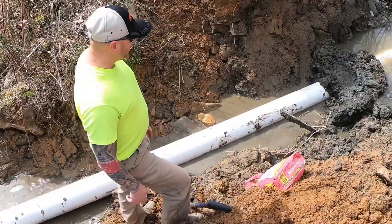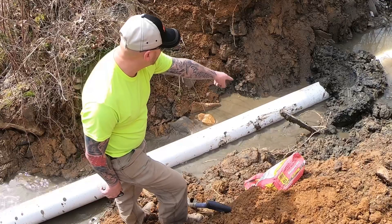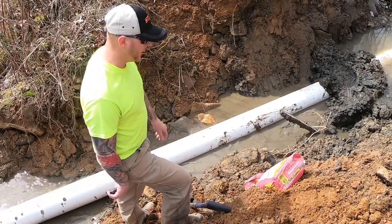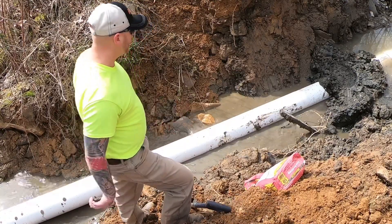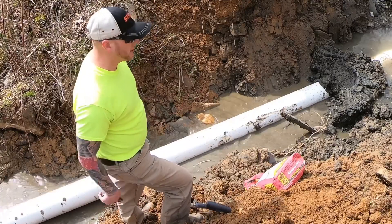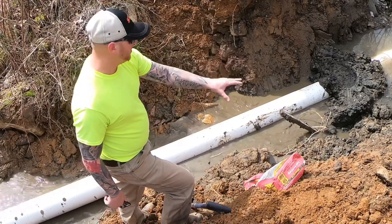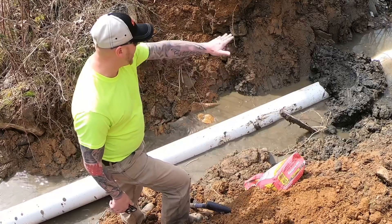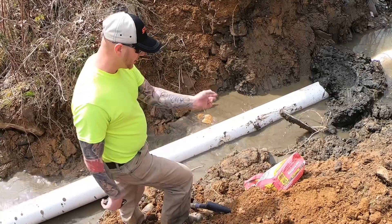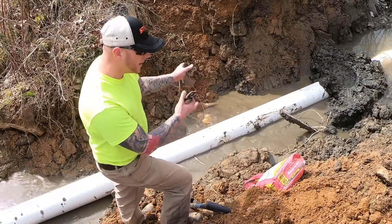The next part I'm gonna have to move quickly and with a purpose. You can see right through there — water's flowing through that little dam I've made. I've got 100 pounds of quick-setting concrete here. Ideally I would have just dammed it up and pumped the water, but since it's a small dam I can do this quickly. I'm going to grab a couple of buckets of soil — good clay here — pack it down and slow that water flow, then run down and split my bags of concrete and pour them on there, using the dirt around here to make a mold.